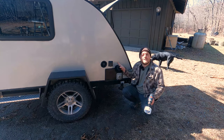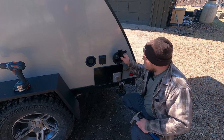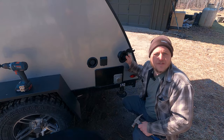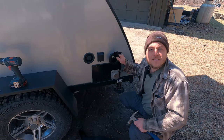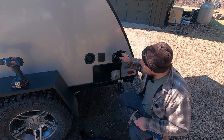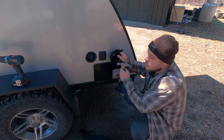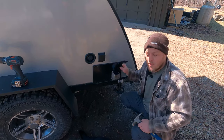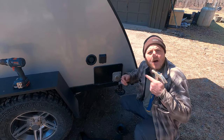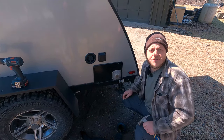For me, I know where my location is, so I'm ready to get started. When lining this up, some folks like to keep with the symmetry of their camper, but I'd rather it be in the most convenient place — even if that means breaking symmetry. Mark it up, make sure you're in a good location, and mark your center point. Some folks use a nail set to put a small dent there, and that helps your drill bit when using a hole saw find a good steady place to start.